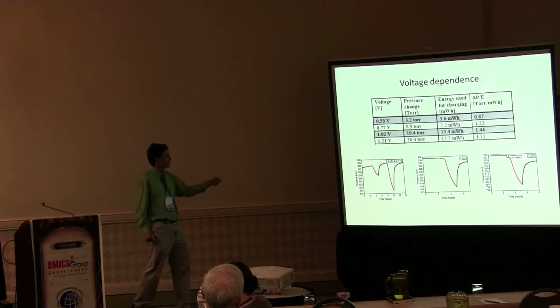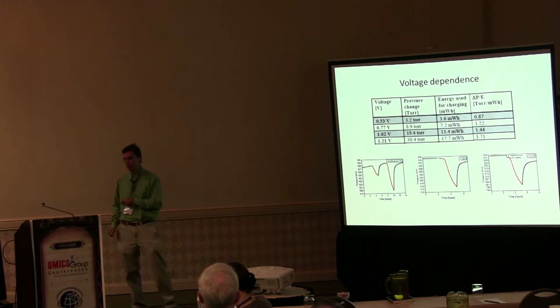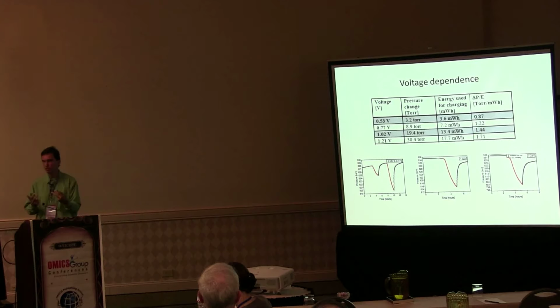Unfortunately, we cannot go higher than 1.2 volts in aqueous electrolyte systems, because otherwise you get electrolysis. However, with organic electrolyte systems, you may be able to go to significantly higher voltages, up to approximately 5 volts.